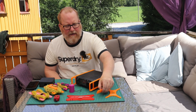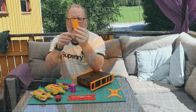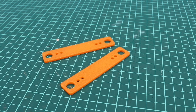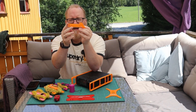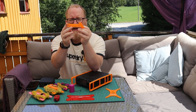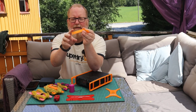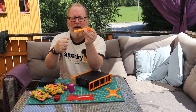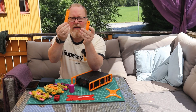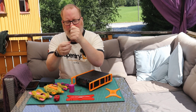And with that kit, I have probably my favorite 3D printed part. These are dipole links and end insulators. I keep a ton of these on hand because they're just so simple to print, durable, and easy to use. There's a bit of strain relief here — just put the wire through these holes and tighten it up, and there you go: end insulator and dipole links. Probably my favorite 3D printed part.